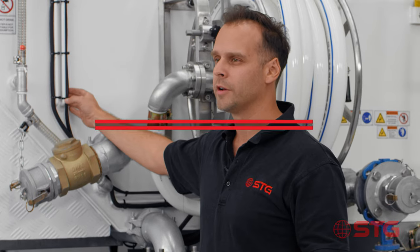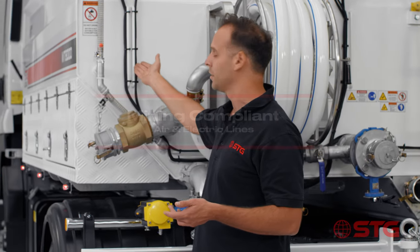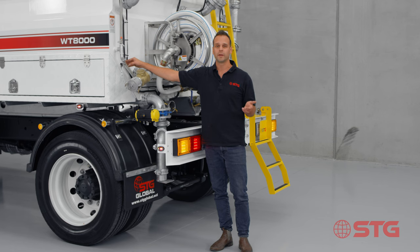In order to comply with mining regulations, we've ensured that the pneumatic system and the electrical systems are two independent systems and are separated, as you can see right here. All of the pneumatics is in solid conduit, not in split conduit.